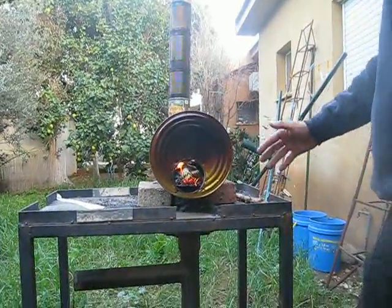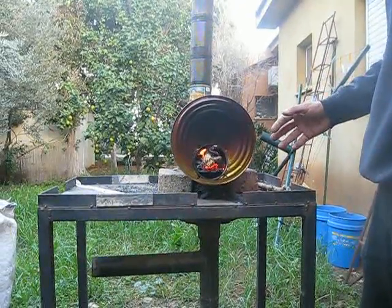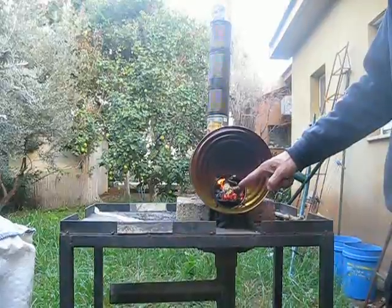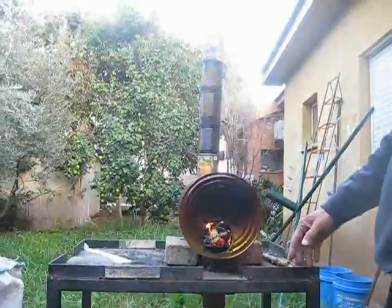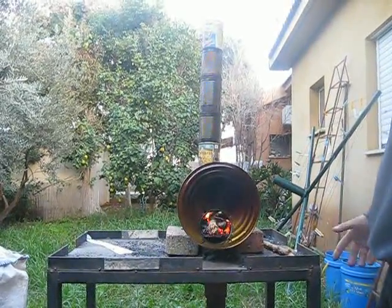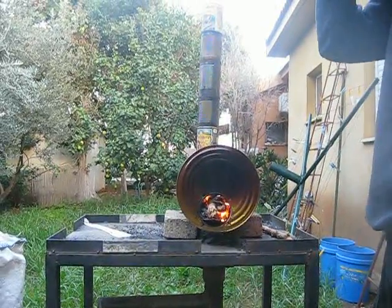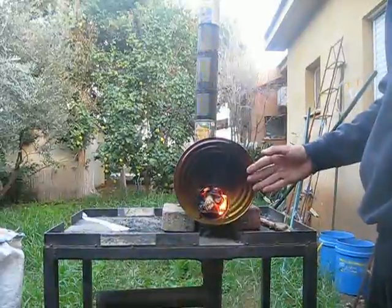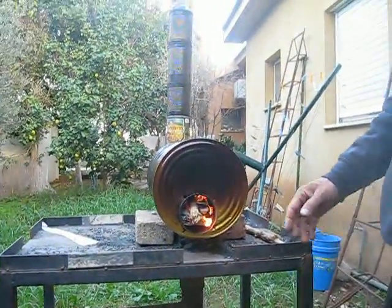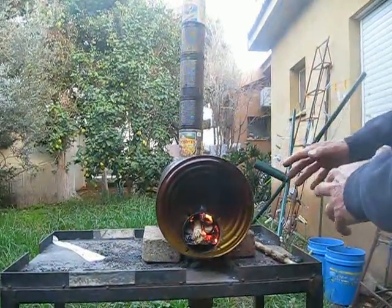In the downdraft it was very difficult — I tried to light it in different ways and didn't manage. With the updraft configuration it immediately starts burning. There is even a bit of wood that is wet and the water is boiling out of it. You can see there is a little bit of smoke still, but I just now lit the stove. I suppose the combustion chamber can be greatly improved, probably by looking at examples of burners used to burn gas, taking ideas from jet engines — adding primary air, secondary air, making a vortex in the large space to create high-temperature fire and warm up the heat exchanger.